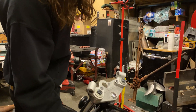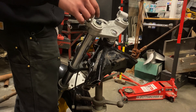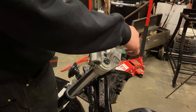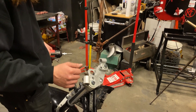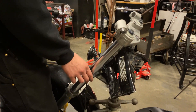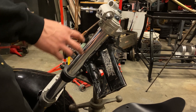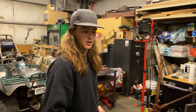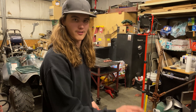I got these kind of chopped off where I might want them to start building the frame off of. I'm going to move the handlebar clamps — I'm going to try to flip them side to side so that way the handlebars come out the bottom to get it a little closer to where you're going to be sitting. I'm also going to loosen up the triple clamps and move the forks up in the clamps to lower it down a little bit in the front, just to get the steering a little lower and reduce the rake of the front tire.